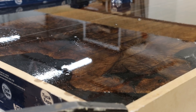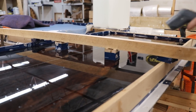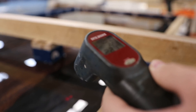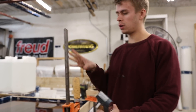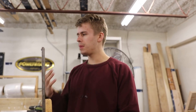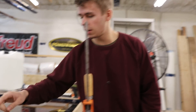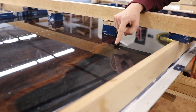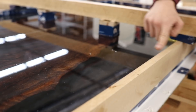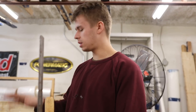It's about 24 hours later since we did the pour for JB Smooth. The first thing I'm going to show everyone is the temperature — the epoxy is about 22 degrees right now, which is really good. We try to keep it below 30 degrees, that way it's not going to cure too quickly, it'll stay liquid for a long period of time allowing bubbles to come up. As you can see if I just touch it, it's still quite soft.